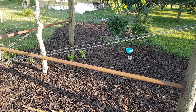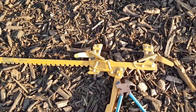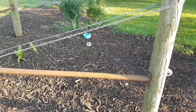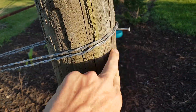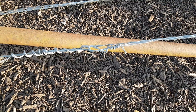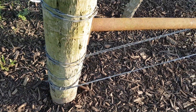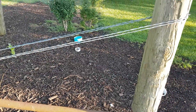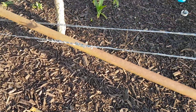I had the idea: why do we even need them? They're used to get the tension on. We have this thing right here called a fence stretcher. I've got my line on pretty snug anyway. All I did was use two strands of smooth wire — I need to put a staple here, don't worry, I just finished — but I pulled it tight. It's not the prettiest knot in the world but it'll work. As you can see, it's pretty simple, pretty straightforward, very clean. No stays to fall out or get loose, no animals playing with a stay knocking it loose, and if I have to tighten this up I just go to that one knot, undo it, put some tension on it, and tie it back in.